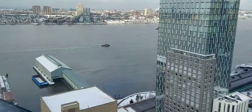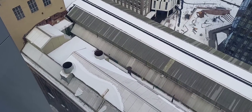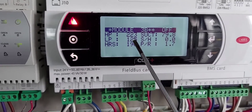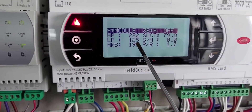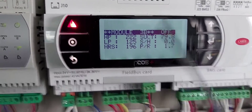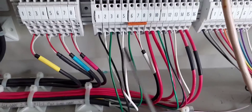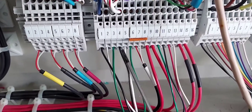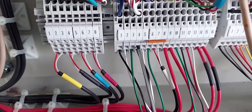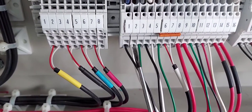Look at that — we're at 125 on the gauge now. This thing is literally on point — perfecto! So I'm going to go ahead and purposely disconnect one of my transducer wires. Based on the schematic, the transducer is on terminals four, five, and six. I'm going to demonstrate right now how to use these spring clamp terminal connectors.